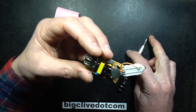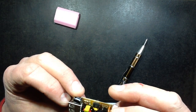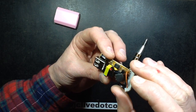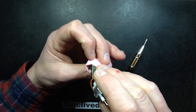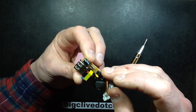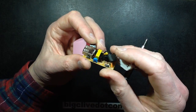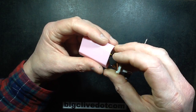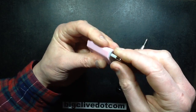To be honest, the electrical separation just isn't actually good enough. If they'd wound the secondary with thicker insulation, and if they'd just shuffled the components a little bit — lifted that capacitor up, moved the opto-isolator down — and used a physically bigger, better-rated separation capacitor, they could have made it better for very little extra cost. But they decided to go the suicide route and make a death-trap adapter instead.